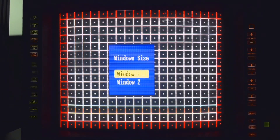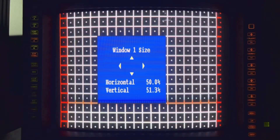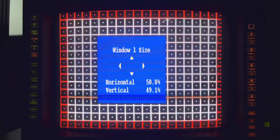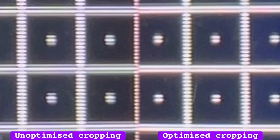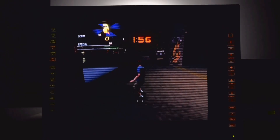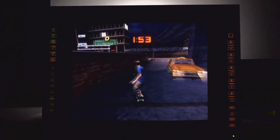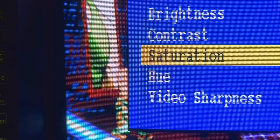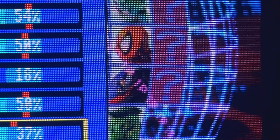You can move and resize the window, and if the downscaled image is outside of this area, then you're best to go back and alter the resolution's H and V start. There's also window cropping, which I assume affects the front porch — adjusting the bottom vertical cropping by just 2 pixels draws most of the dots from 3 lines down to 2 and a bit, which looks a lot more focused. The video settings have controls for white balance and colour correction, convenient for games with darker scenery. Altering the sharpness didn't change a thing, so you won't be able to simulate classic RF.